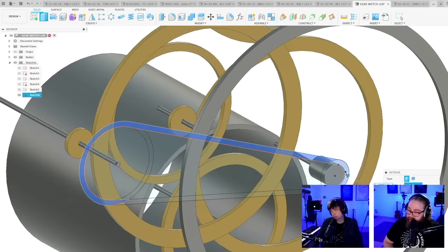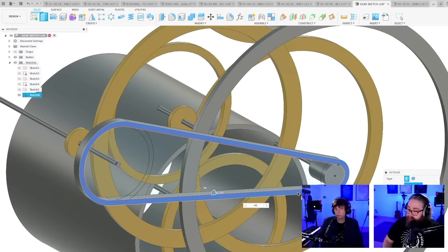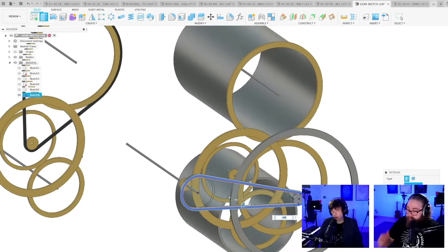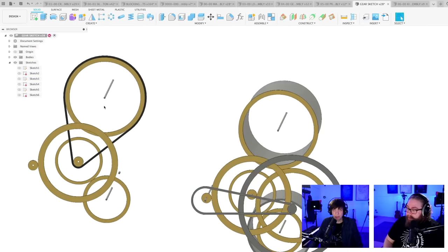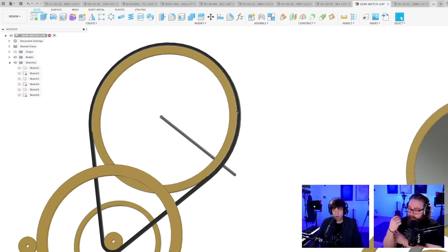Harrison Dean Hoffmeyer: I definitely agree with some other chatters, though, that timing belt skipping teeth is a solved problem in industry. The belt just needs to be sized properly for the torque demand and kept tensioned. Okay, that's really good information. Also, if we look at this timing belt, it's a meter around the whole thing. Up here, this belt is not gonna skip teeth. So it's not gonna skip tooth on the big thing.